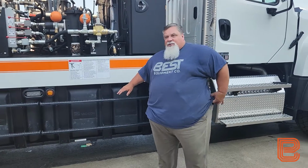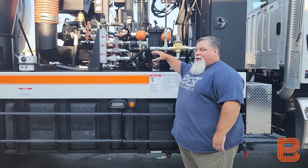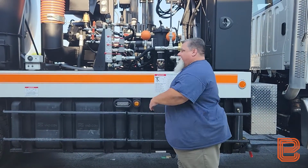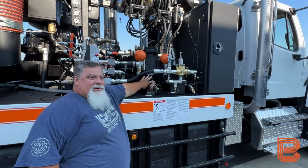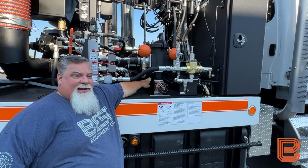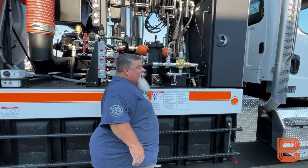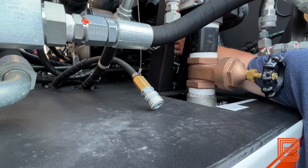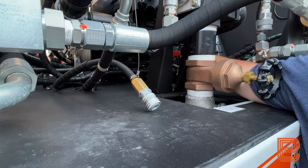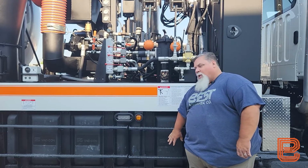Once all our water is drained from the water tanks, we can move up to our water pump area, and there is a ball valve located at the back section directly behind our strainer at the lower side of the water pump that we need to turn on in order to drain the water from the circuit. Here is our drain valve. So that's closed, open.